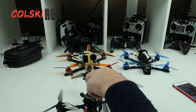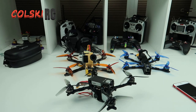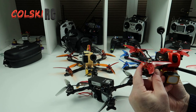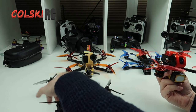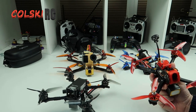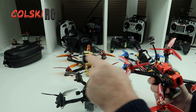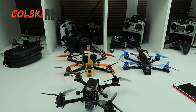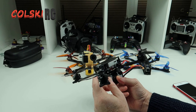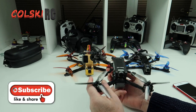So with that aside, this Coppies frame is going to come out of here - I'll be checking this in bits because there's no point keeping it if I don't like it. I'm going to use this frame to rebuild my Tyro 99. I haven't flown it for about 8 months and I did like it, but it's got limitations - the motors are very good but the frame is ridiculously heavy. So we're going to take all this gear off it, strip it back down to bare frame, and I'll print a new part for the back to mount the antenna. This frame just won't be what it is intended for anymore. We're going to replace the motors - all this gear is going to come off in one piece, I hope, and go into a new frame. I have no idea what frame I'm going to buy yet. There's one with a double stack on the top that looks really strange but I might give it a go - it's not a bad price, I think it's mid-30s. Or we might go for the Transtech frame which I do like the look of. This will be coming out and going into there.